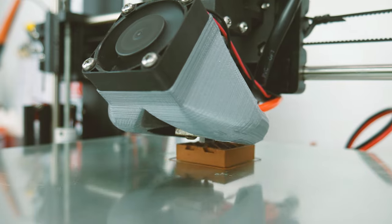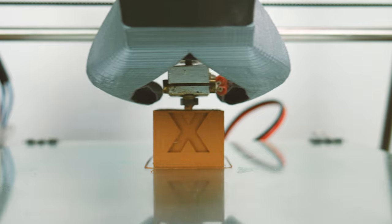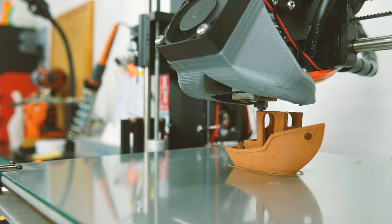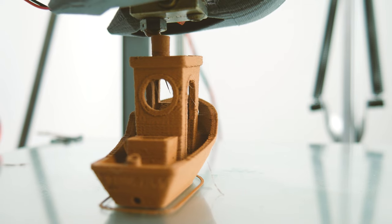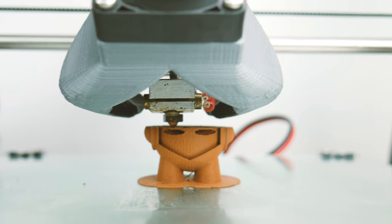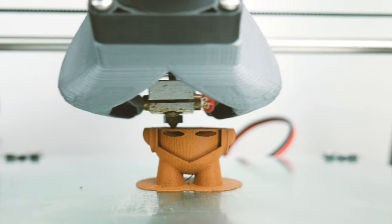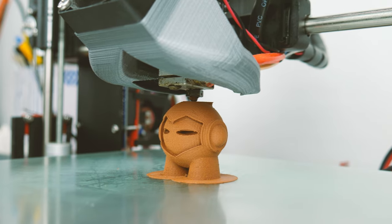Let's see how this filament prints. As always, I printed my three usual test designs: a calibration cube, a Marvin, and a 3D Benchy. Using an E3D V6 at a 0.2 layer height, I found 195 degrees to be a great printing temperature, and a tiny amount of hairspray on glass — with or without a heated bed — great for adhesion. However, this may vary for you.